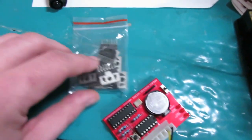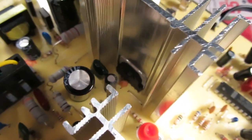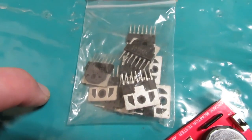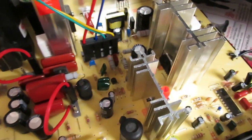We've maxed out on the adjustments — when we crank up the vertical size it doesn't let us stretch the screen all the way to the top and bottom. The only way to get over this is to replace that IC with something more beefy. I ended up ordering a bunch of these — they're super cheap, like 10 or 15 cents each. These are one step up: the original is meant for small to medium-sized TVs, and these are meant for medium to large size.